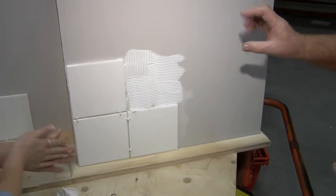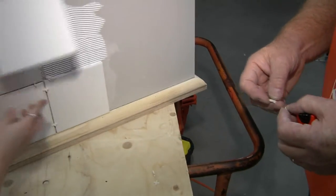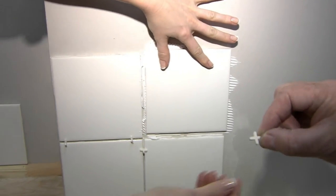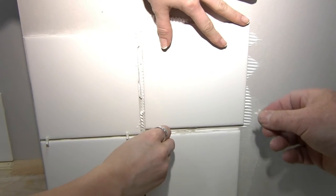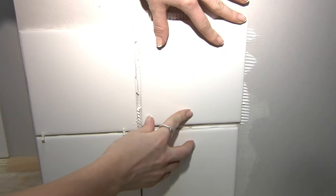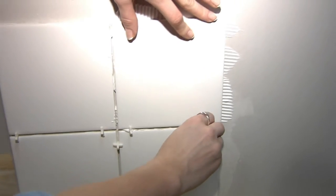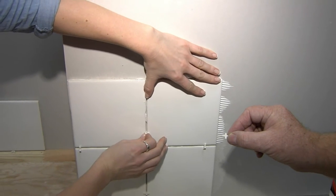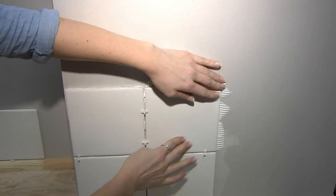Because we're putting a new tile up here, we need to get a consistent space on the grouting. You're going to place the tile just above and just to the right of the existing tile. You're going to use these little eighth-of-an-inch spacers, setting them vertically on the tile — not flat in the corner. Then push the tile down until it meets the spacer. How long will this actually stay wet? You've got about 30 minutes or so to move things around. So don't go for lunch — if you come back you're going to have hardened material you'll basically have to break off.